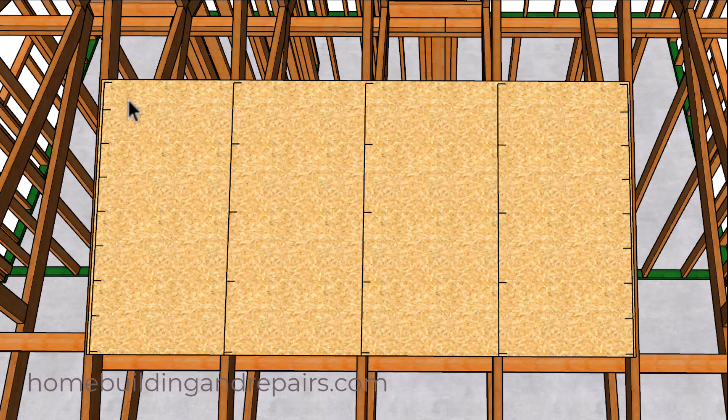The first number, six, is perimeter nailing. This is the perimeter of the plywood. Now even though we won't be able to perimeter nail this part or this part of the plywood sheathing, we will be able to nail over here unless it's blocked around the edges, or the upper section or the side is going to be touching the fascia board.